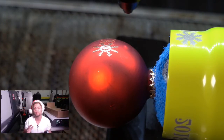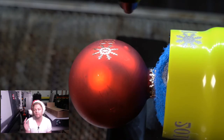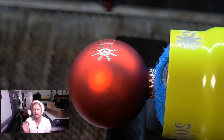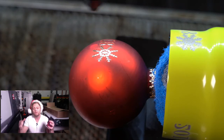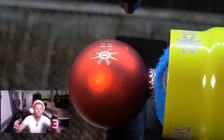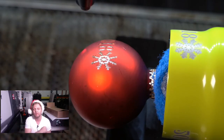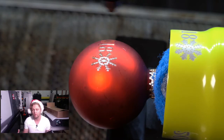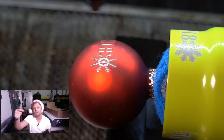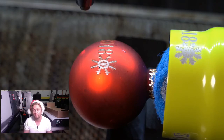You can see that double pass is really cleaning up that first pass, and that's a good way to test something if you don't want to put too much power in it all at once. Remember, when using the rotary, it's going to set up your Y-axis so it runs extremely slow — like a sloth that's going to crawl. And if you take off your rotary and then try to run your job normally, you're going to notice that the gantry goes up and down very slow, and that's how you're going to know it's still in rotary mode.